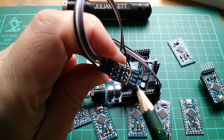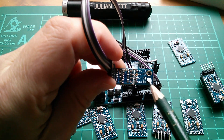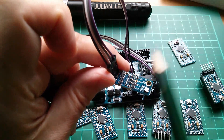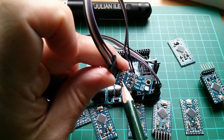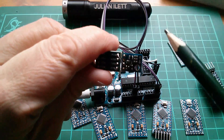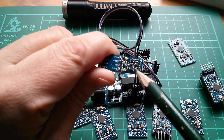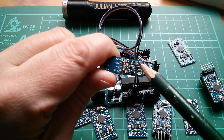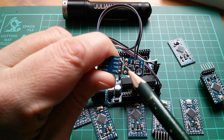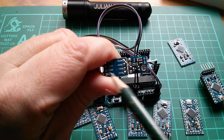If you're following this project, the level translator board that I put between the Arduino and the sensor board is completely unnecessary. I'm amazed it still works, because those level translation components — two MOSFETs, a bunch of resistors, and also the 5V to 3.3V regulator — are actually on the back of this sensor board. There's the regulator, 5V to 3.3V. That tiny six-pin chip is a dual MOSFET, and there's a quad pack of 10k resistors. So this board has its own level translators; you don't need a second set.